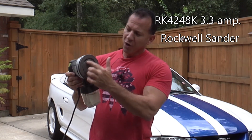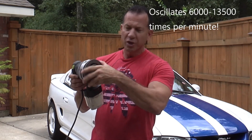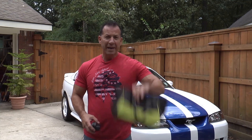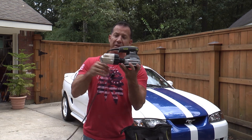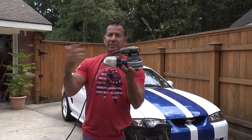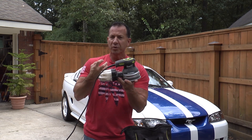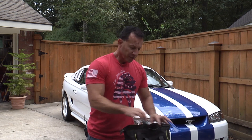I mentioned at the beginning of the video that I have a giveaway with two of these Rockwell sanders. This is a Vibra Free — this thing is really pretty stout, 3.3 amp motor. The inside ring spins one way and it oscillates, and the other one goes the opposite way, so it cuts through really well and leaves a lot of room for vacuum, so it sucks in a lot of the dust. This sander comes with a bag and it has a vacuum port that goes on here to hook up your shop vac with the adapters, and you also have the dust collector right here which really works great. I don't even use my vacuum a lot of times even indoors because this thing really takes a lot of the dust in and circulates it well. It actually collects dust better than any other palm sander I've used. You have three different pads that come with it — five of the 180, five of the 120, and five of the 60 grit, so it all comes together and it's ready to go. I used this thing for a couple of months and I'm really happy with it.